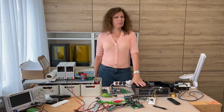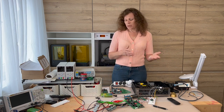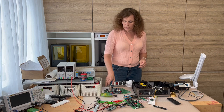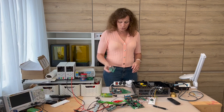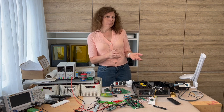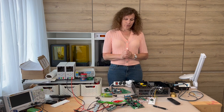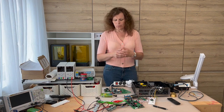The first step was to listen to the I2C bus — what is the communication, what and how are they talking to each other. I used my own breakout board as an I2C sniffer; first I tried my oscilloscope but it was quite complicated, so I used the sniffer. I got a detailed list and was able to identify all the functions of the CDM2, and that was my starting point for creating my own microcontroller board. It's not completely finished — it's a work in progress — but I'm on a good way.